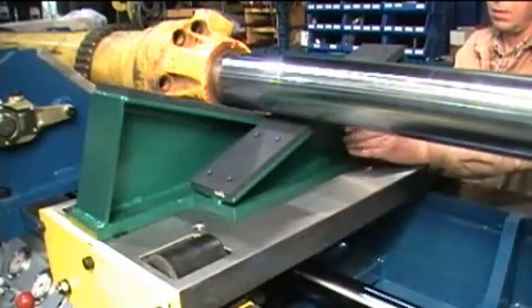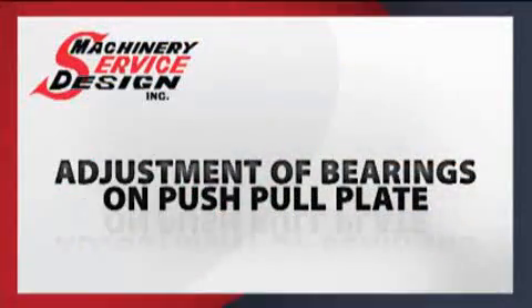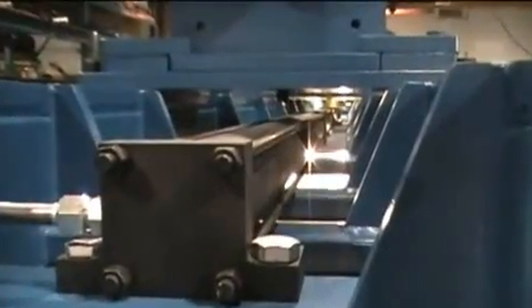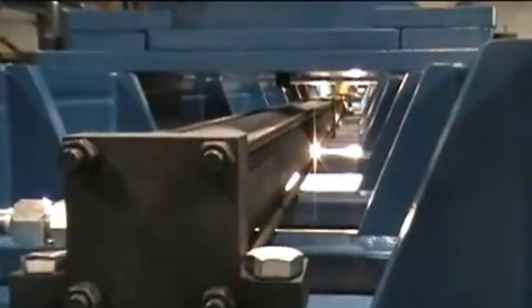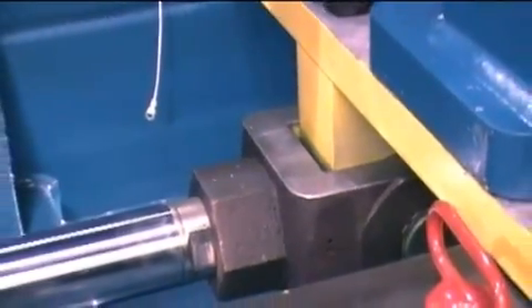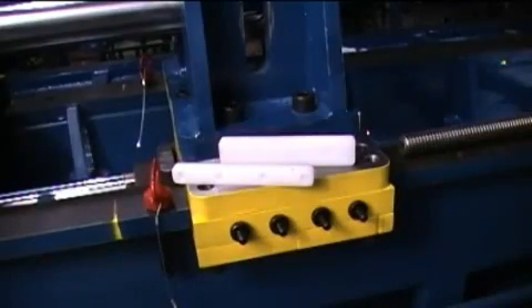In some cases, the operator will have to move two bolts to reach the correct adjustment on the supports. The heavy-duty bench is available with a 4-inch bore by 11-foot stroke hydraulic cylinder that is used to provide hydraulic power to pull hydraulic cylinders apart and to reassemble. The cylinder assist is attached to the cylinder brace tool. This brace tool is equipped with UHMW bearings on the top, side, and bottom surfaces.